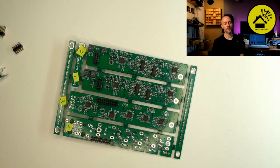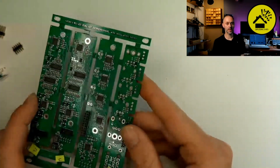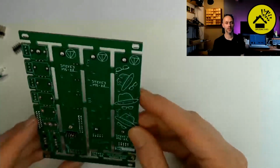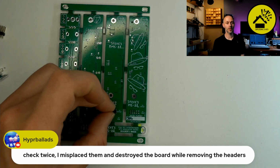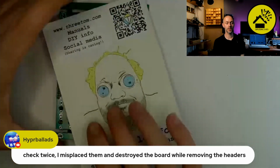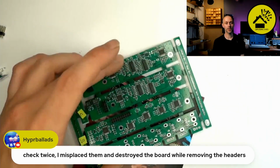And always when you have these pin headers, it's quite dense, and the next solder joint is always very near to the latest one. What you should do in this case is come with your iron from the side where the solder can flow to. Means you come from this side where you don't have any connections which are very close to that one, because the solder always flows to the hottest point.